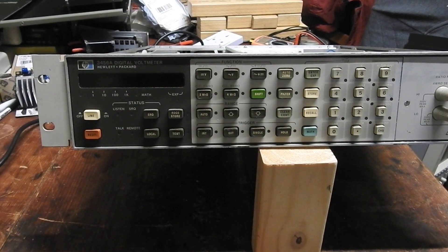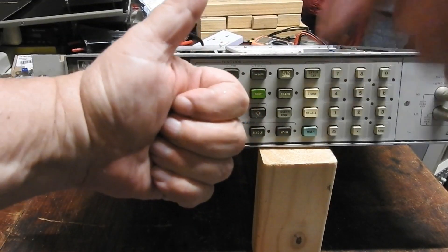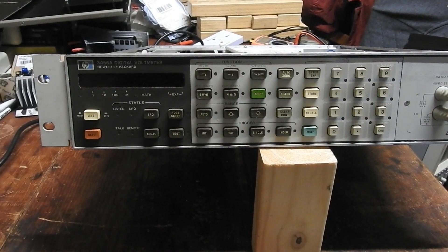Obviously that makes every power supply capacitor in all four of these types of boxes I've got suspect, so I will be looking for something to replace them all — maybe a 25 or 35 volt 4700 microfarad capacitor to replace this one. So that was a bit of an anti-climax. Makes me wonder — was it worth making a video? But we got to see what's going on inside this thing, so I think it was. I hope you enjoyed it. Catch you later.